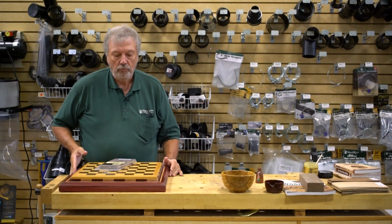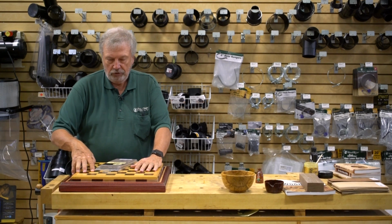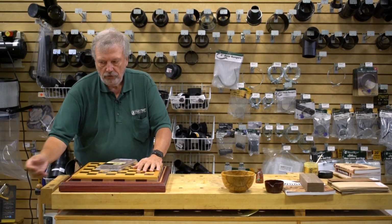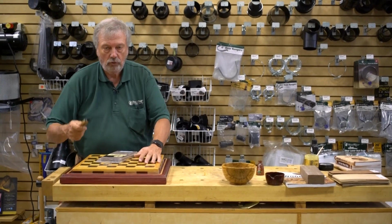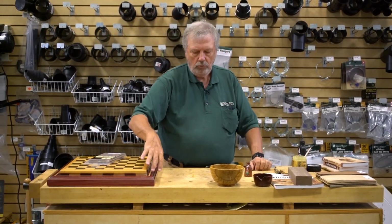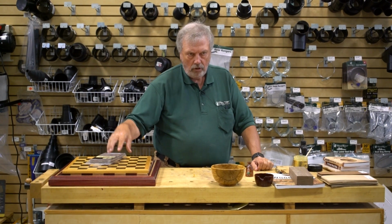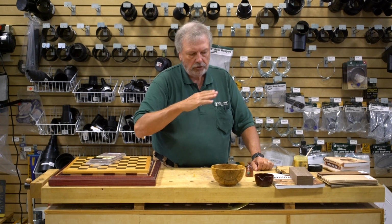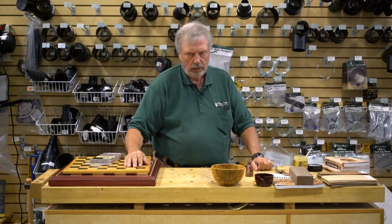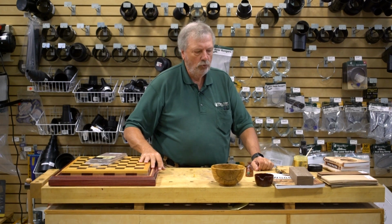Cutting boards are a whole different matter. So for a cutting board, I'm not using beautiful wood. I'm using dense woods or medium density woods. I'm not going to waste beautiful side grain like this on cutting boards, even long grain cutting boards, because if you start cutting it over time, it's going to slice the wood up. No, that's for nice projects. You want people to look at it and go, ooh and ah.